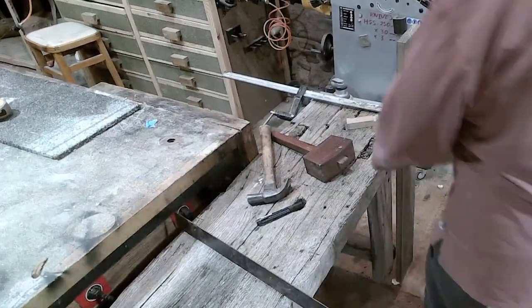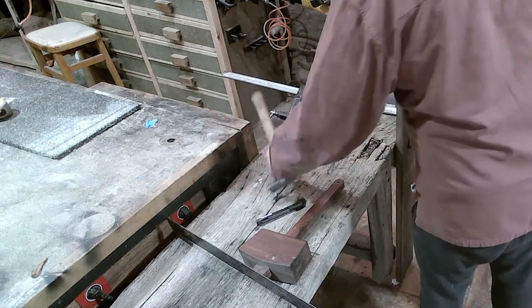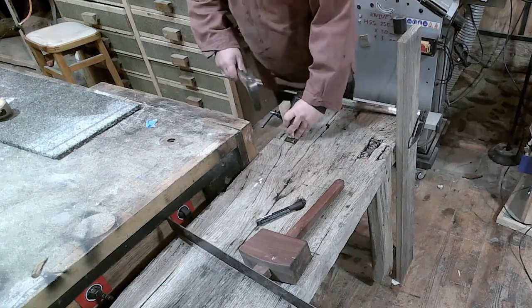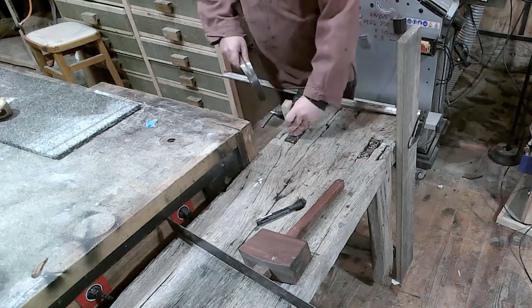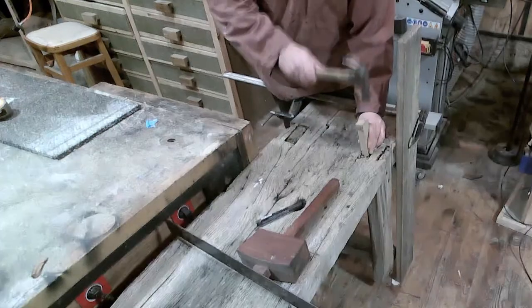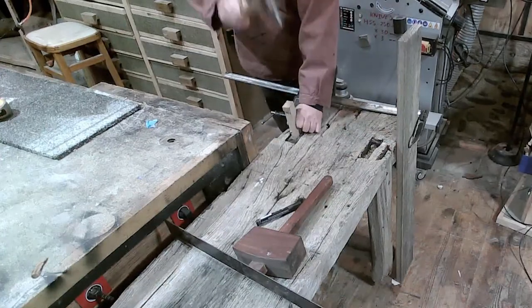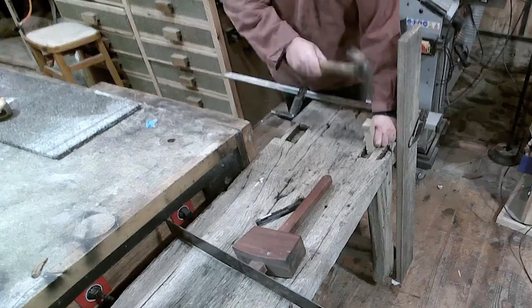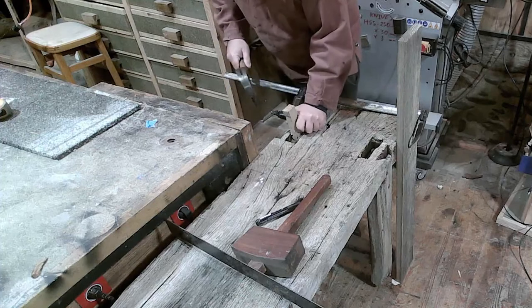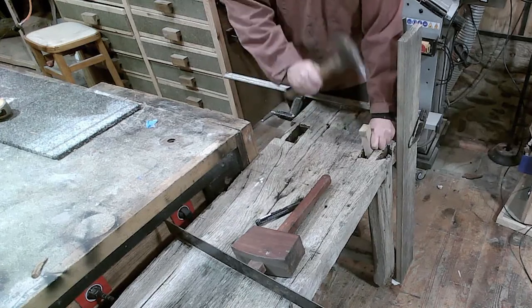There you go. So we're going to try and drive the leg set out. They should come out. They're not. I can't remember if I used Cascamite glue or not when I put them back in again and wedged them. But they've been wedged, and it's deteriorated somewhat since. Oh, they're going. That's driving. Although they look pretty manky, it's actually quite tight. The wood lice are coming out. They obviously like it.